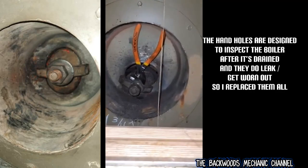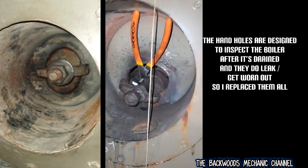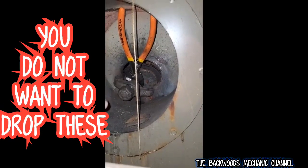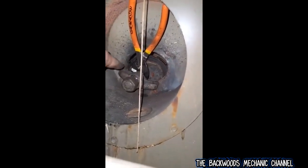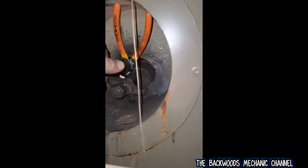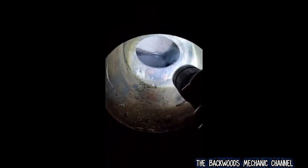We got some new gaskets to put on it - these little rubber gaskets right here. We're going through the top half of the boiler and taking all this apart. It's set up so that if you drop anything, it goes straight down into boiling hot water - you'd have to drain the boiler to retrieve it, which we've already done. You take the fastener off, then take those arms off, hold onto the threaded shaft, and wiggle it out. It's like a little puzzle because it's egg-shaped - you flip it around, pull it forward, drag it out.